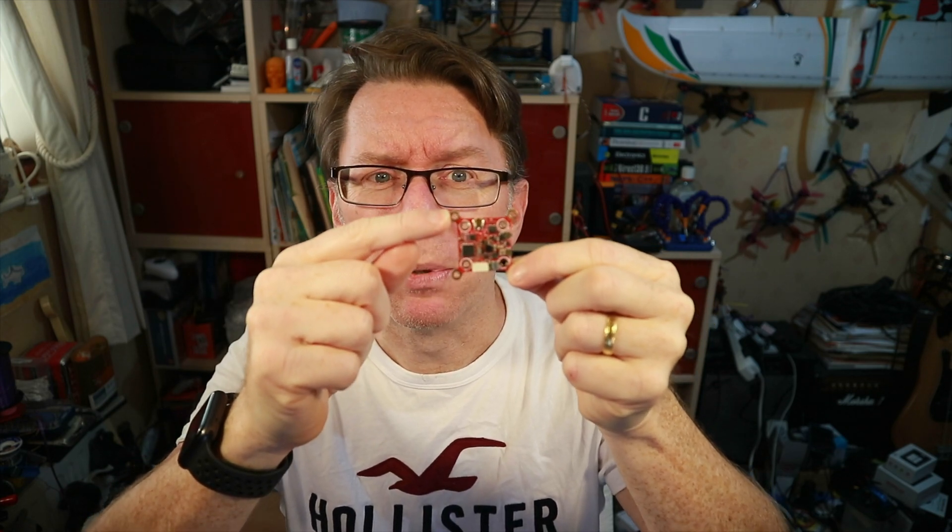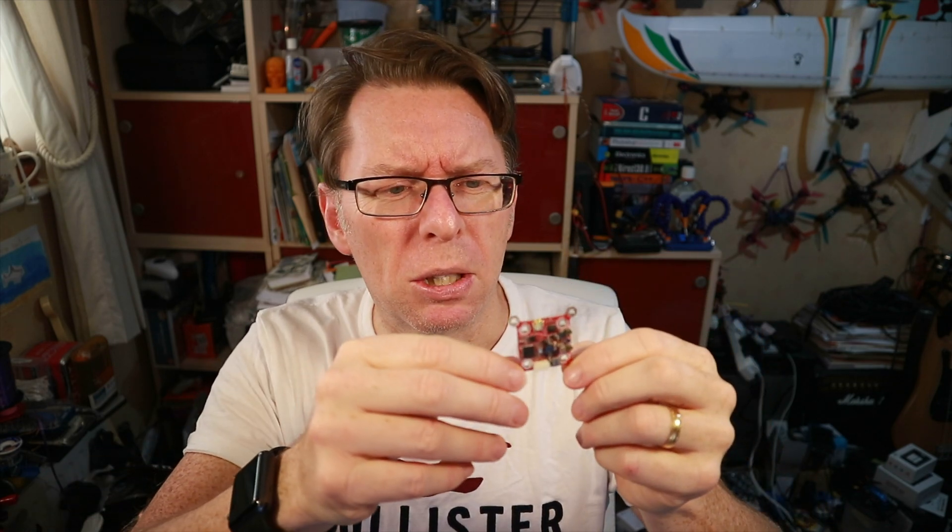This little VTX performed very well and I was particularly impressed by the 25 milliwatt performance — possibly the best I've seen out of any VTX I've used doing that same loop where I always get static, and I wasn't getting any breakup at all. In fact all the different power levels look practically identical, so I think this could take you a long way. The big difference between this and a lot of other VTXs is the fact you can mount it on your 30.5mm stack or your 20mm stack — so generally your five inch or three inch are catered for. The only misstep for me is the LEDs — they're useful for showing band, channel, and power, but you just can't see them when the board is in a stack.